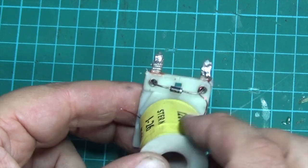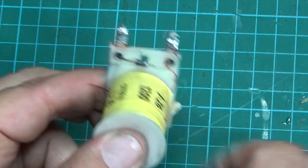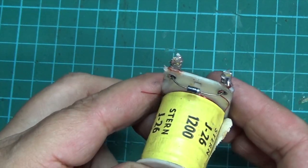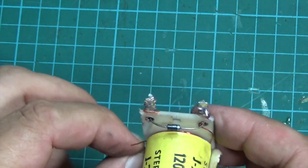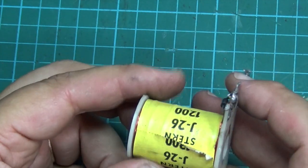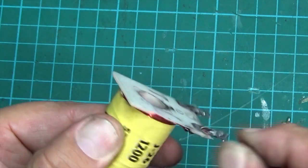So it'll ignore the solenoid altogether and just put all its power into the transistor, and you just get this lovely popping sound as your transistor goes. Done that. Anyway, easy to do. So what we're going to have to do here is just to try and see whether this is a problem that we can fix, or whether there's something more sinister.